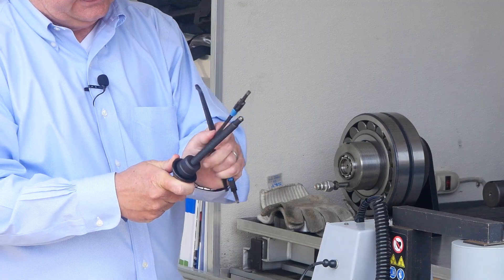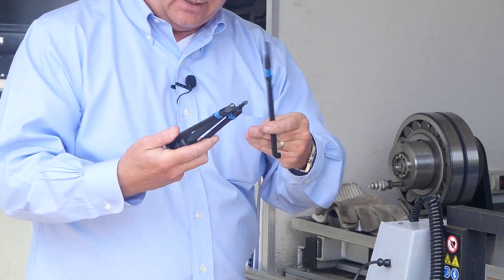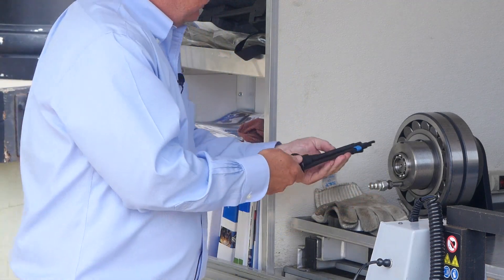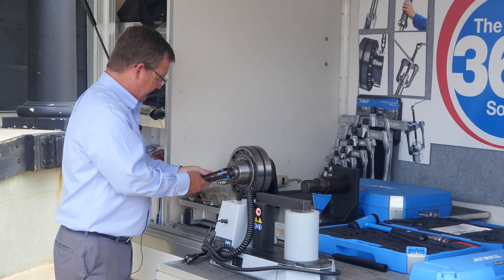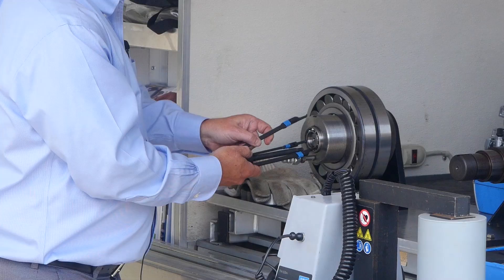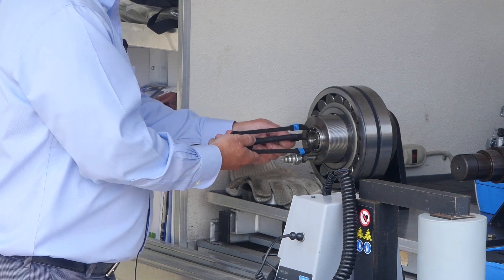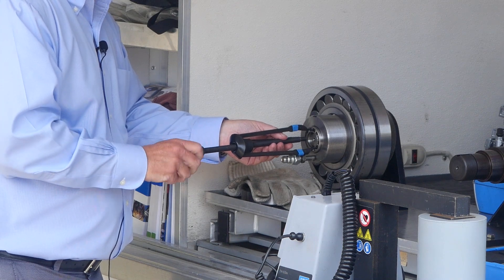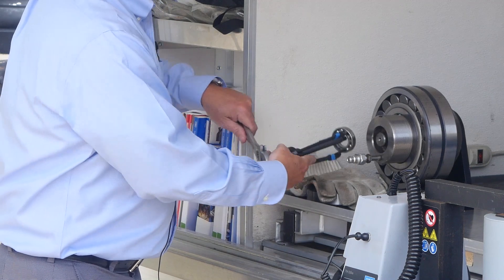In order to assemble the tool, you just mount the arms under the rubber cap. The arms will fit into the bearing in between the rings, in an outer ring. Then you just tighten the threaded rod. Using a wrench to turn this knob, you'll extract the bearing from the blind hole.